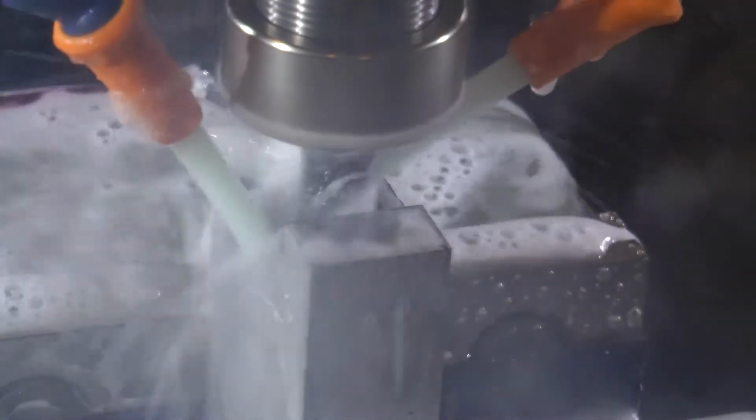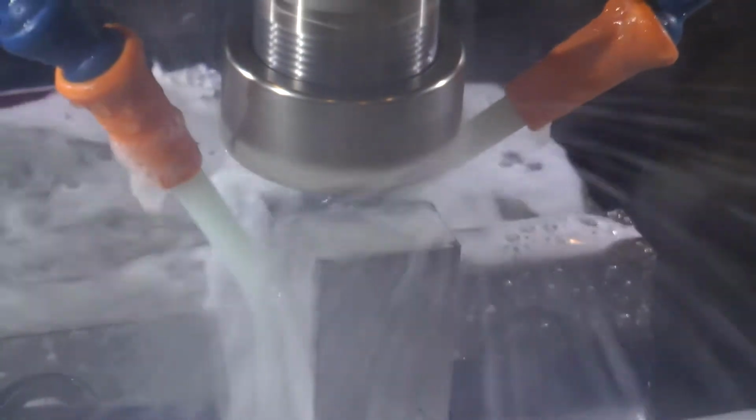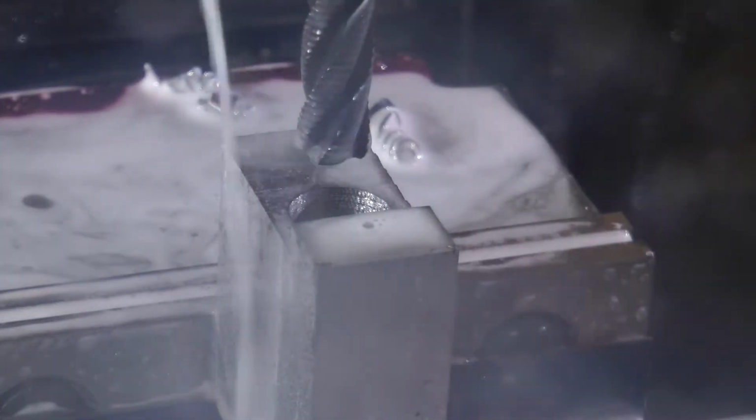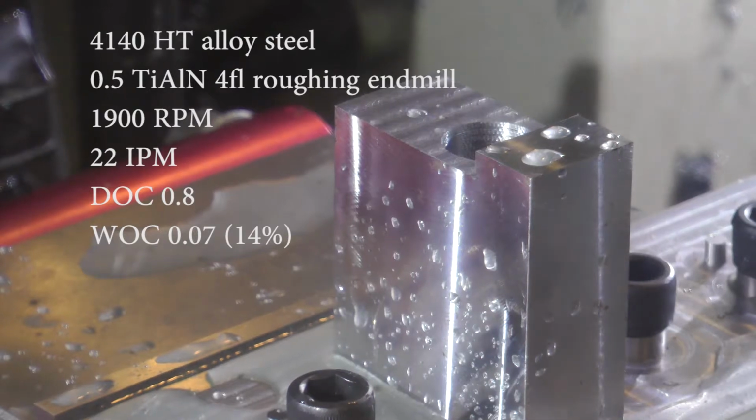And I guess I have to double check the code, but maybe that thing is wobbling in the vise again. There just must be a tremendous amount of radial load put on that part. But anyway, it's chattery and I don't like the sound of it. So I'm going to definitely figure out a better way for that.